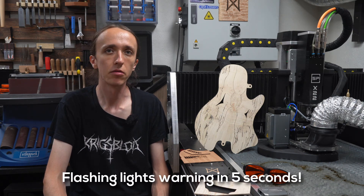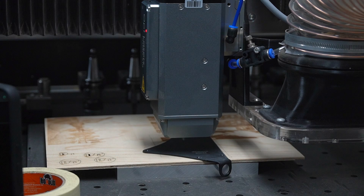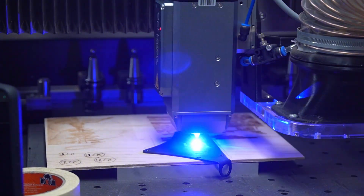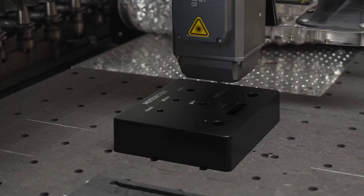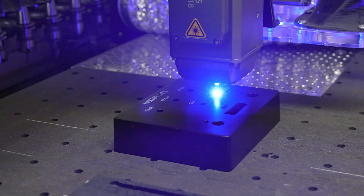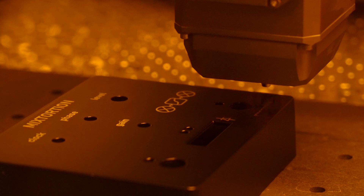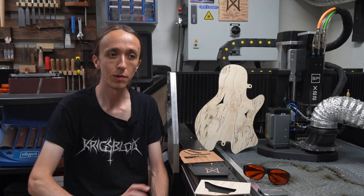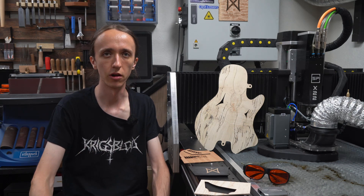For engraving other materials apart from wood — one thing I do a lot of with my laser is engraving my logo and serial numbers on the back of my guitar electronics covers. I make those out of aluminum, then spray paint them black and etch away the lettering with the laser. For this, once again, there's more than enough power. I'm using a fairly low power setting in the lower power mode, just scanning back and forth at 2,000 millimeters a minute. You could also very easily etch away anodizing on aluminum, which on some lower-powered lasers can be a bit of an issue — you need a decent amount of power to properly burn away the anodizing — but no problem at all with this one.